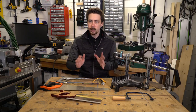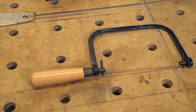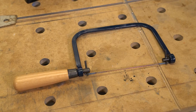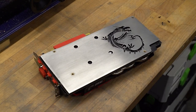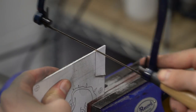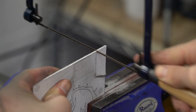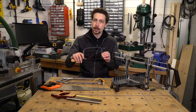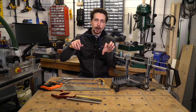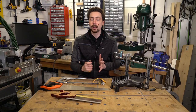Another really useful tool I use on a very regular basis is a coping saw. A coping saw is really good for detailed work, especially if you're doing sheet metal. We did an MSI backplate a long time ago on a scroll saw, but we also finished some of the details off by hand using a coping saw — almost anything you can do on a scroll saw you can use one of these for. They're quite easy to be very accurate with since you can take your time. There are different varieties — this one has quite a serious bow, and you can also get jewelers' saws which are really long and give you a huge amount of reach around large pieces.